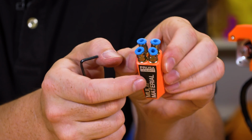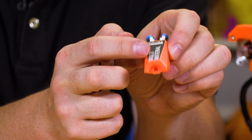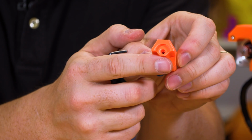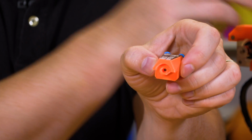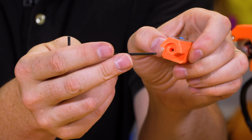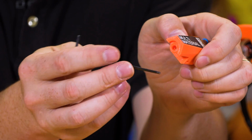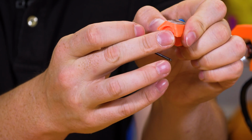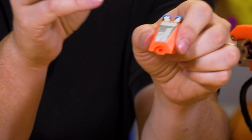This is the piece right here. Filament goes in right there, and it comes out right there. So what'll happen is you'll get a piece that jams because of the heat, and it comes up through that Bowden, or it comes up through that PTFE tube, and the fluted end kind of expands because of the heat if you're running too hot. And then it pulls it up against this, and it kind of forms this blob, and then it won't fit through that PTFE tube anymore.